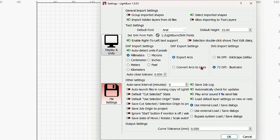All right, so here we go. This is the second layer now. It's engraved. I'm just going to take a stiff paintbrush, and I'm just going to whisk it like this with the grain. And keep in mind that you should be doing both of these either with the grain or against the grain. Both of them should be the same so that the look comes out good. And then I'm going to just go side to side like that. And you'll see that all of the soot and the debris is now gone. Looks perfect.